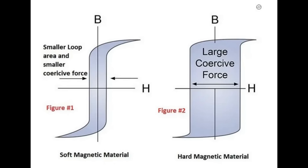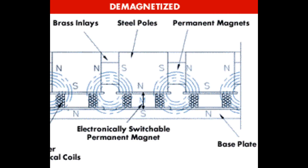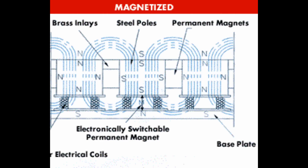What that uses is a property of hard and soft magnets. Hard magnets are magnetized and it takes a lot to demagnetize them. A soft magnet will demagnetize relatively quickly — an example would be Alnico. Alnico can have its magnetism changed by applying a current to a coil, swapping it between north and south. This creates the electro-permanent magnet switch used in magnetic chucks where you don't have any moving magnets. You pulse it with current and it changes position, so the flux can be directed in and out of the bed plate to operate as a switch or chuck.